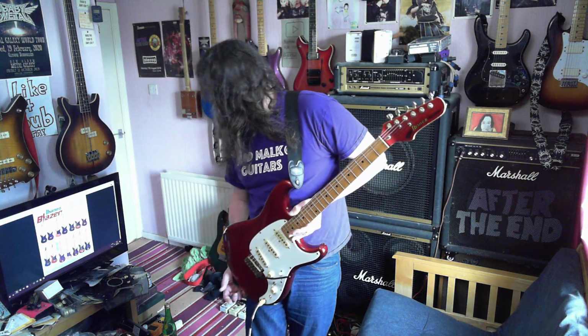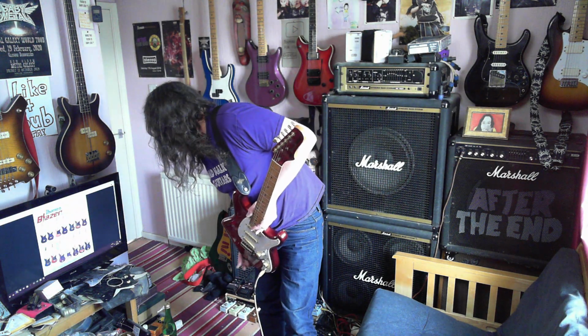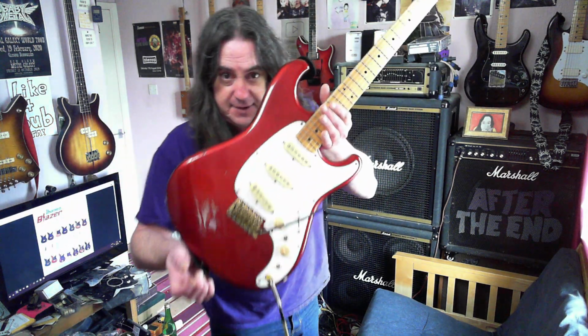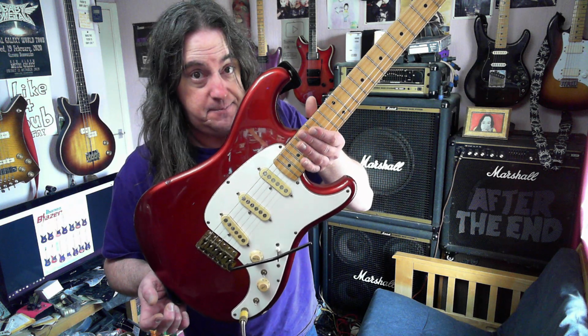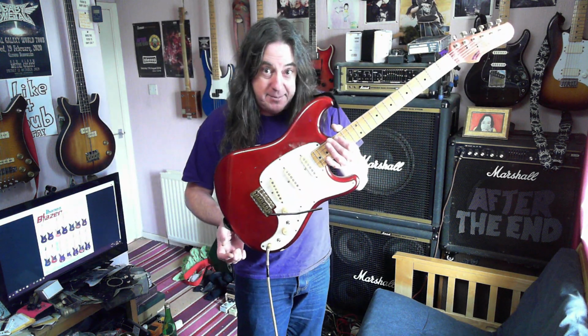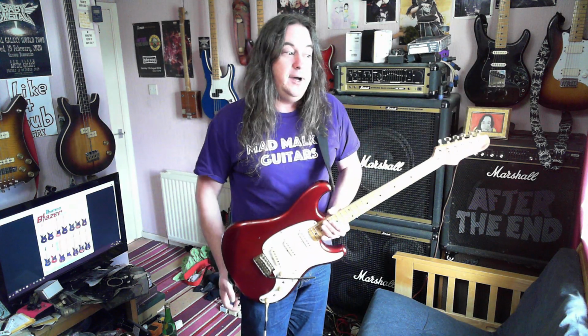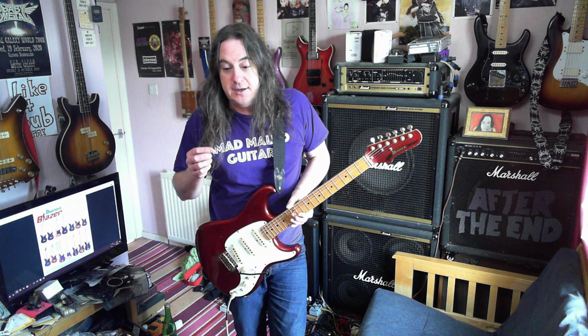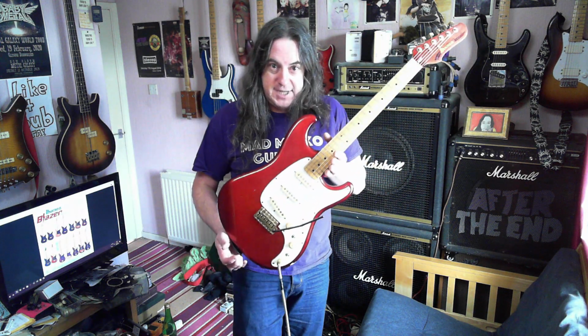So looking up information on this, it has Super Tap 6 pickups. And they've got 3 adjustment screws, which is pretty rare for single coil pickups, but they're coil tapped. Although I'm probably guilty of it myself sometimes, so, coil tap, but it's single coils. You may be saying that's because coil tapping's not the same as coil splitting, or coil defeat is what Washburn used to call it.